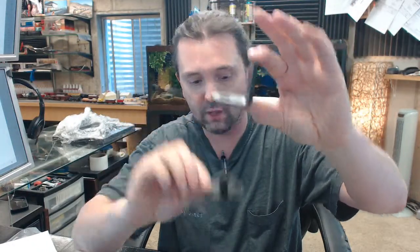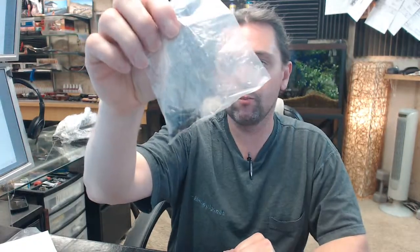This is the bottom portion, what you're seeing here. In the top portion I've got the jam bracket along with the top pivot, and of course a package of screws will be included. What this is used for is lightweight doors, about 30-inch wide or less, that are between 7/8 and 1 5/8 thick, that do not exceed 50 pounds,